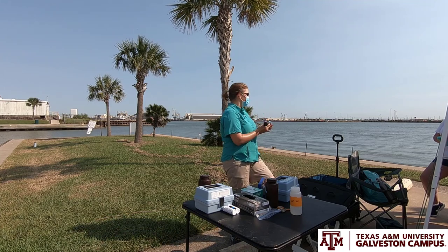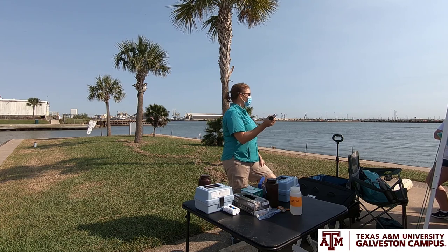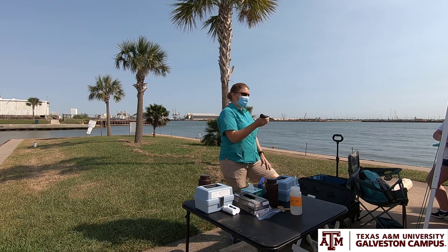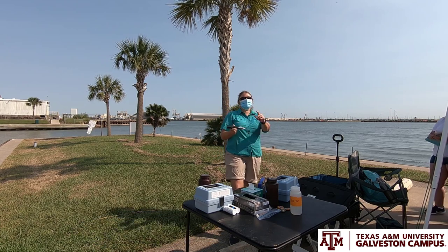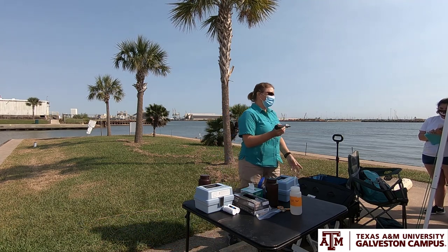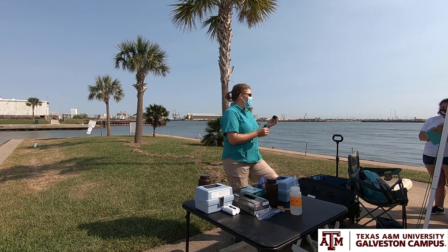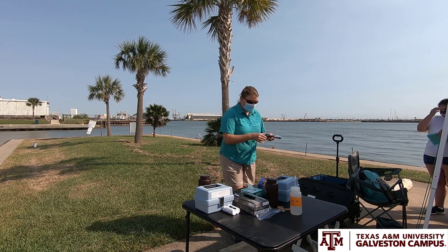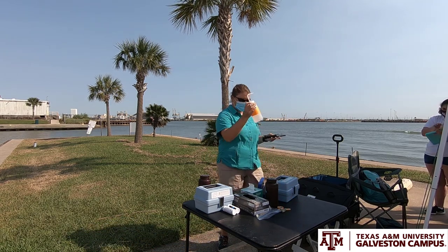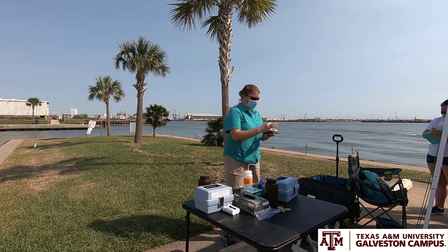Nope, this is actually a refractometer. It looks at the bending of light, but it measures salinity. So we'll use this to measure salinity. What you want to do is use the DI water, or fresh water that doesn't have salinity, it has zero salinity, and you're going to squirt a few drops on here, on that blue rectangle space.